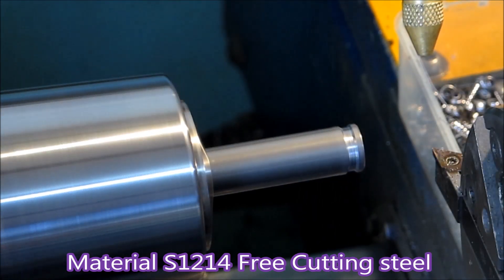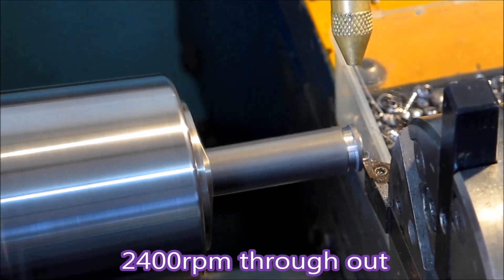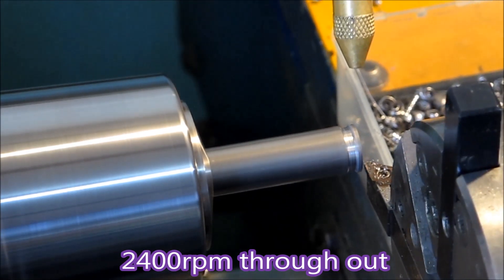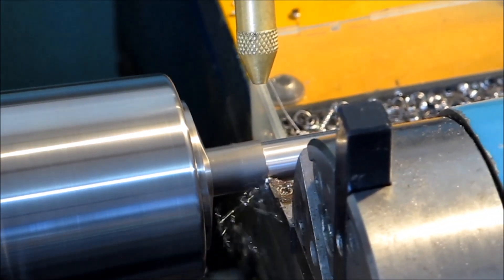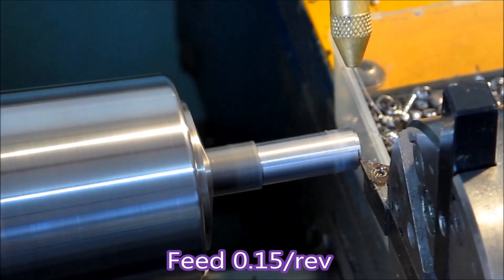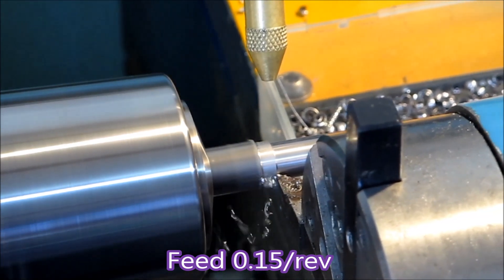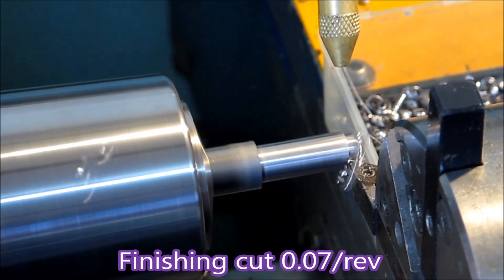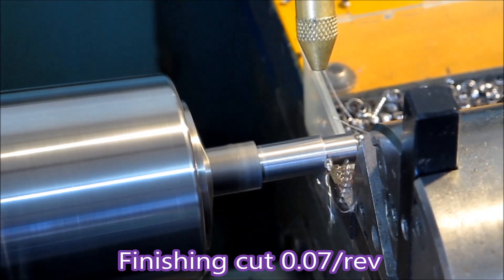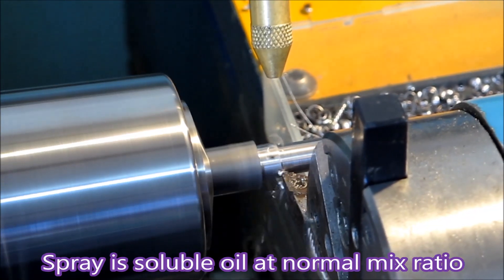You can see we're holding the steel in the 5C collet. It's actually cheating a bit because we're using a half-inch 5C collet to hold 12mm steel. This makes it a bit easier to release, because if you use a 12mm collet to hold 12mm steel it can be very difficult to get it to come forward when you've parted off the previous part.